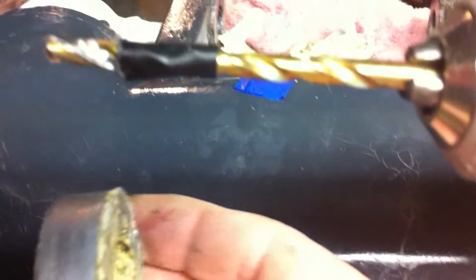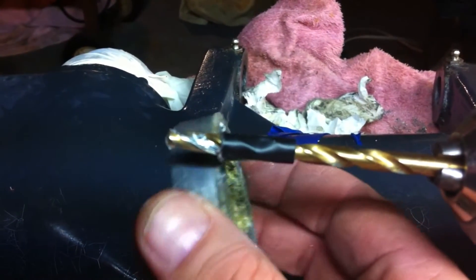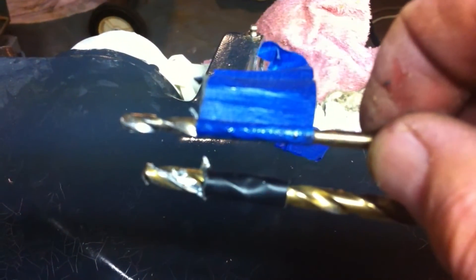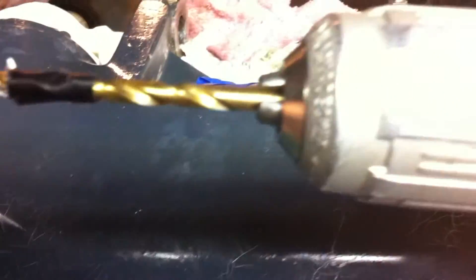To drill the holes you need a number seven drill bit, which is thirteen sixty-fourths, and you need to put a flag on the drill bit with some tape so that you don't over-drill. Here's an old zinc from a previous year — set the flag with some tape and then you know how deep you need to go. I found it's easier to use a smaller bit and drill a pilot hole first, and then use a quarter-twenty tap to tap the threaded holes into the zinc. Work your way around and generally it'll come right off.